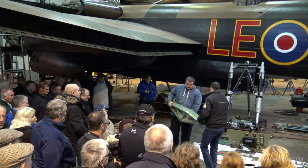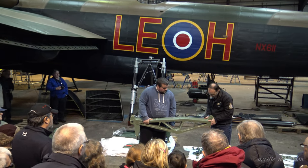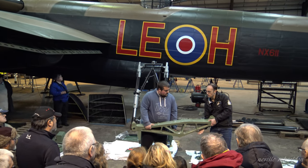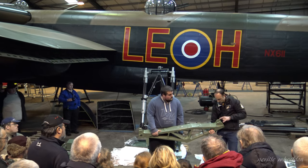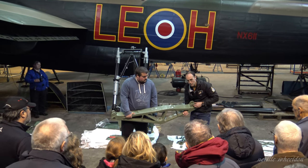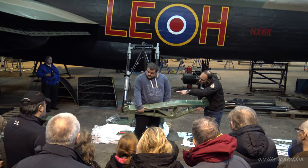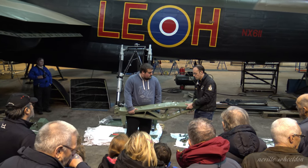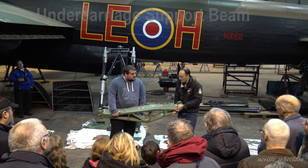So this is an aluminium cast — forged — item, which is then machined and material wasted away in certain areas with holes drilled. The top face, where my right hand is, sits on the main spar of the aircraft — that's the forward face of the main spar — and then this protrudes forward. At the bottom end is where the undercarriage is bolted to it. There's a big bolt that runs through the top spar and a big bolt through the bottom spar, with more bolts through the web. The top lugs are where the subframe bolts on, and at the very bottom you have the bottom of the subframe and the undercarriage. There are two of these on each side; both have been NDT'd — all the holes have been eddy-current tested to make sure there's no cracking — and they've passed as perfectly serviceable, just as they came out of the factory.